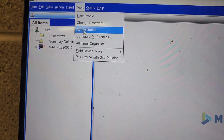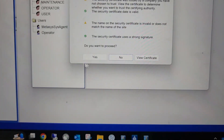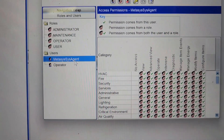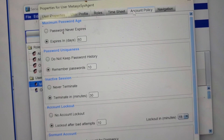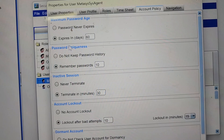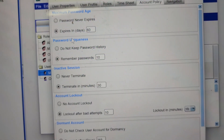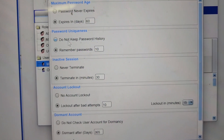I'm going to go to Tools, then Administrator. What you want to do for your administrative policies — I've got this pop-up, no big deal, I'll take care of that later. You want to make sure for your sys agent or whatever that you set up your policies so you're not going to lock yourself out. I'm going to set my account policies — you can set it to password never expires, whatever — but it really depends on what you do within your system. Just remember all of these before you lock yourself out.